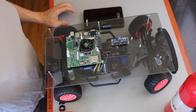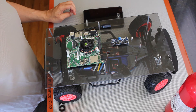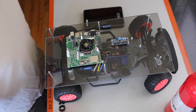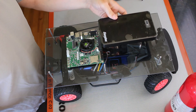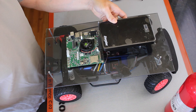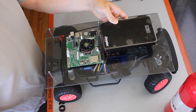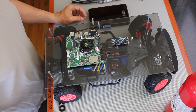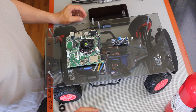At this point, I think the thing that makes sense is not to use the PCA9685 — there's no reason to duplicate what UPenn is doing better with a microcontroller. So we'll get rid of this and use the Teensy 3.2 as our first step. But eventually I think we will want to go to the VESC, just so we can get odometry out of the car. The same goes for the battery — it's easy to mount and easy to recharge, so you don't have the same safety issues as with a regular LiPo. The next step is basically to integrate the Teensy microcontroller to control the steering and the ESC, and load up some software so that we can get this little pig rolling.